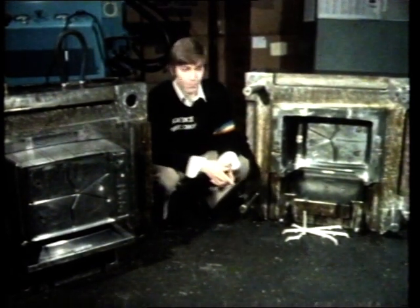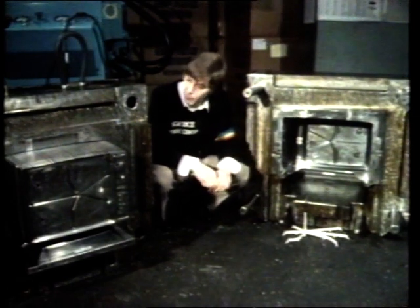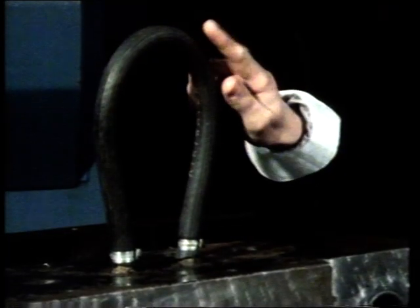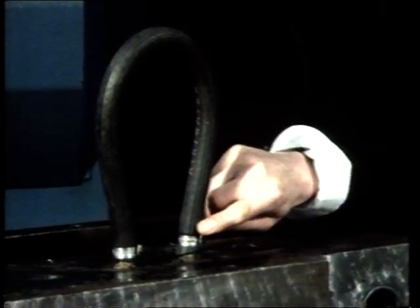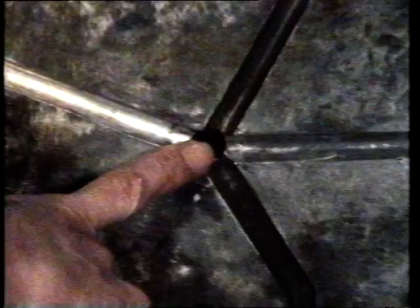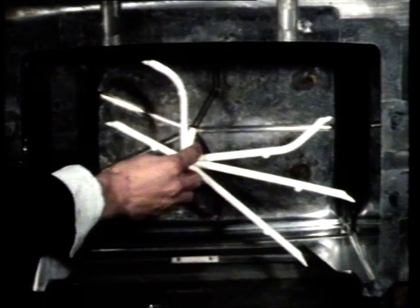Let's have a look at a mould. It's in two halves, made of steel, and it's very heavy. It's cooled by water pipes inside. When the two halves come together like jaws, there's a space left — that's where the plastic material is injected, through this hole, and along these runners to the sides of the mould. The plastic sets hard in these runners and has to be removed while the plastic is still warm.